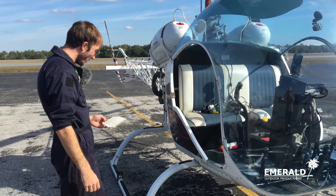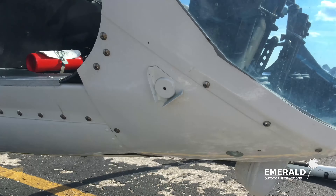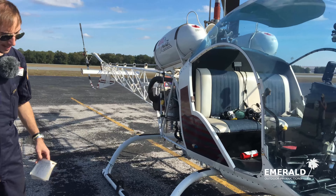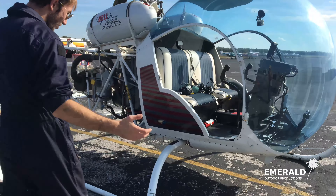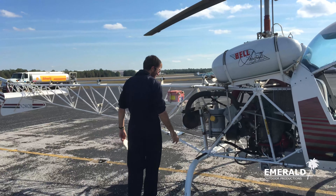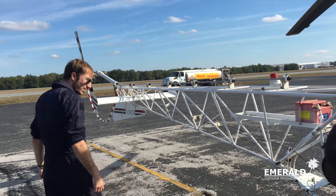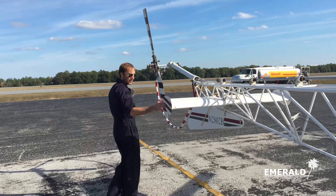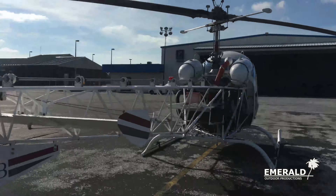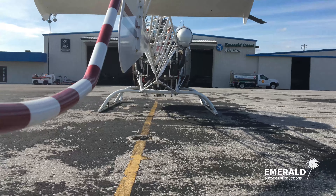We look at the left tank and drain it — there's a little fuel petcock right underneath. Drain a little bit of fluid from the left tank to make sure there's no water in it. If you fill up the tank after landing there isn't enough air to produce moisture, so if you leave the tanks always full it's actually better for the aircraft — you won't get as much water in the tank, especially if it's sitting in the hangar for a couple of months.